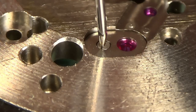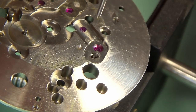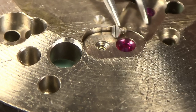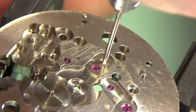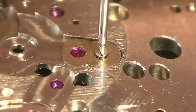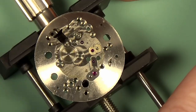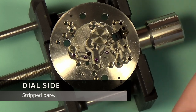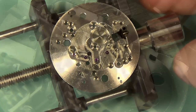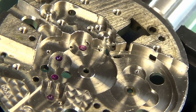All that's really required now is to remove those two cap jewels. The screws on these are fairly microscopic, but they allow for easier servicing of the watch, increase its longevity, and are easy to oil and replace. This ETA movement was very, very nice to work on — a very nice movement. There you can see our cap jewels. So here is the dial side of the watch completely stripped bare, and here is the back side of the watch completely stripped bare.